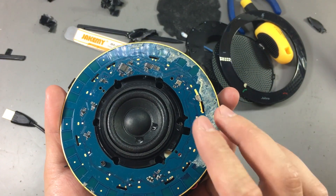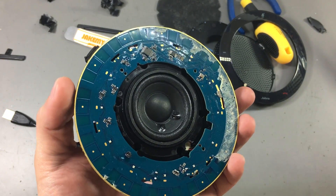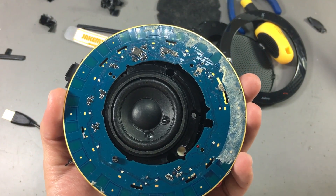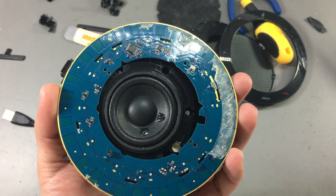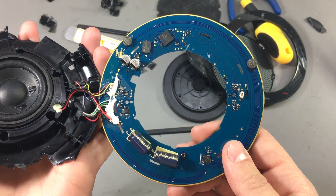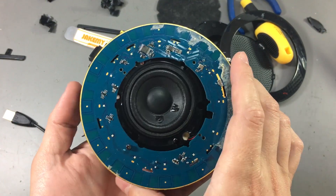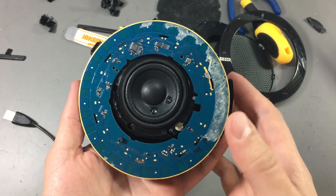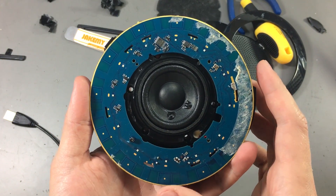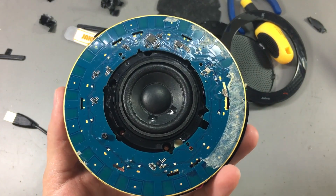So that's about all I had to say about this speaker. It's quite an interesting design to use that Bluetooth chipset with the Bluetooth interface disabled, but it totally makes sense because it has all the functionality you need built in and you can reuse firmware while buying more of the same device, which lowers your BOM cost. Let me know your thoughts in the comment section below. Please hit the like button — thank you for watching and I will see you next week.